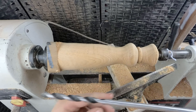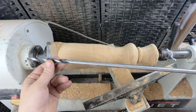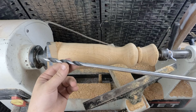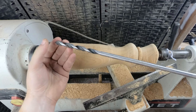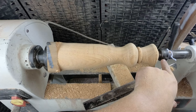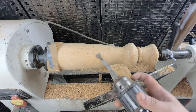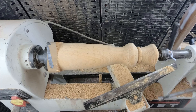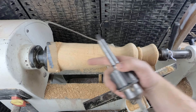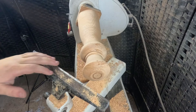Here's the drill bit I'll be using — just a nice hole throughout the whole thing for the wires. It's huge, and it's so long that it's actually very wiggly at the end. Last time I tried that it made a hole after a while but it just was not centered at all — so I have a lamp in my basement that just doesn't look right. What we're actually going to do: get your Jacob's chuck, use this forstner bit which is much shorter, make a hole nice and centered, and then come in with the long bit and drill all the way through. But first we need to take off the tail support and turn the top a little bit.